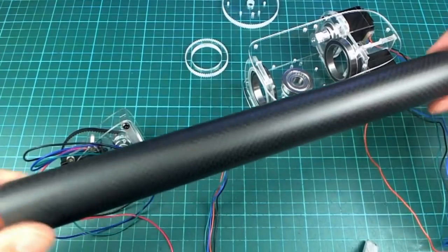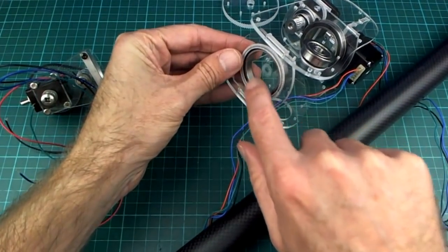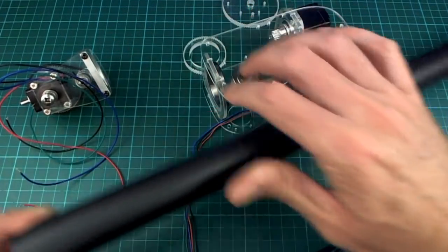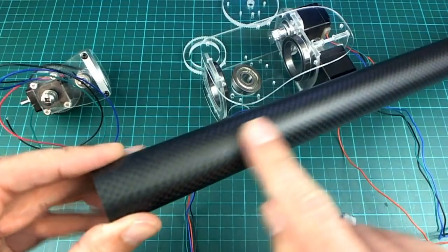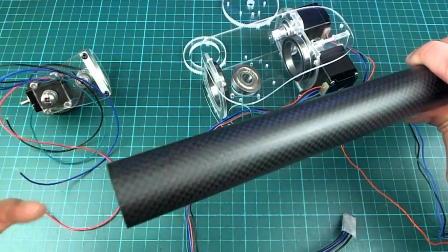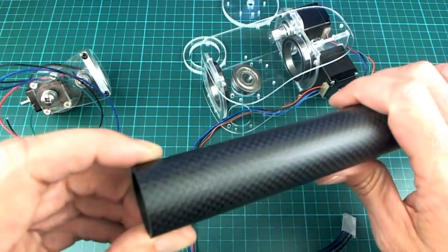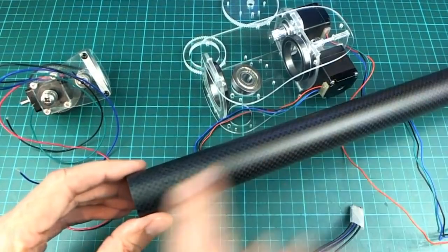The other reason why I'm a little bit reluctant, or a little bit scared to go on with the next step, is that these bearings are extremely tight on the pipe. They don't go on at all on one end, the end that I just showed you. They will go on to the other end, but you can only slide them on to about here, and then they get stuck. So I might have to sand this pipe down a little bit to get them to move better, or I could try a little bit of lubrication and maybe put another tightly fitting pipe over this and tap down with a hammer to get them to where I want them to go. But either way, that's probably going to leave a lot of scarring on here or mess something up. In any case, what I'm trying to get at is that I want to know exactly where they're going to have to go before I start trying to put them on.